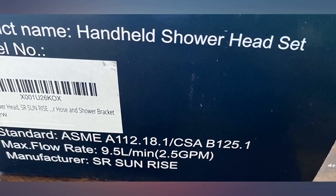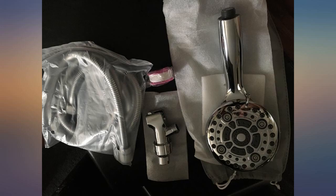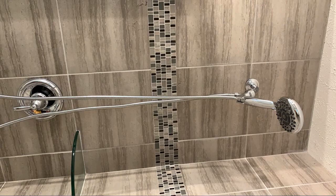This is a fantastic shower head, but the flow can be a little dissatisfying because to sell it in California it has to be rated at 1.75–1.85 GPM at 50 PSI water line pressure. That is not much flow.